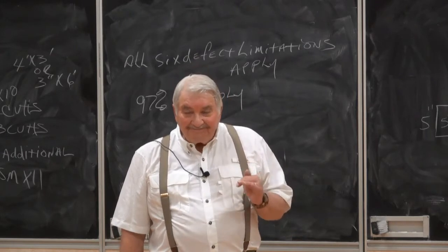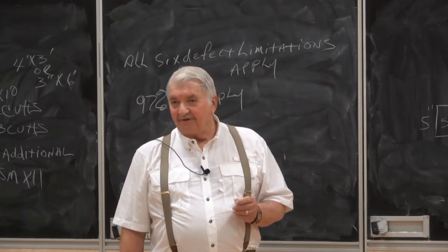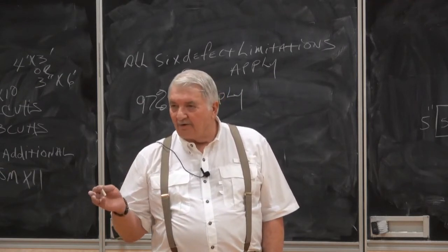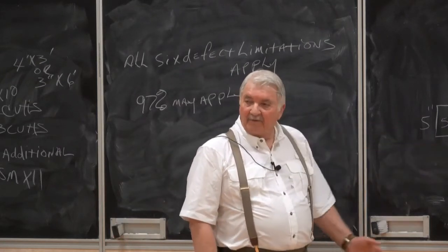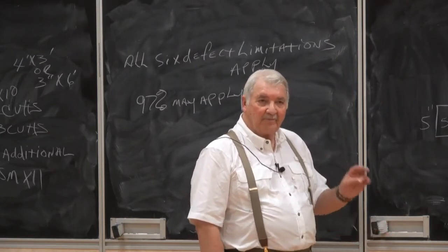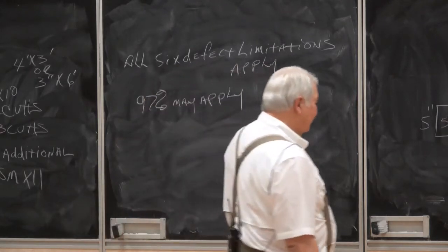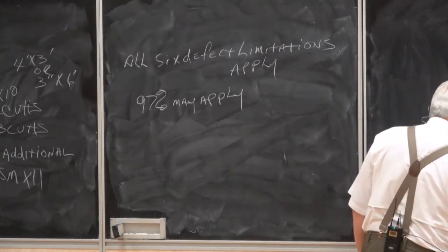Now, FAS one face walnut, that is a different deal. All right? If you have FAS one face walnut, there's two ways you can make an FAS one face walnut. One of them you're already familiar with, okay? You make FAS on the better face and a reverse side not below number one common, which we haven't talked about one common walnut yet. It's a little bit different, but at any rate, that one you're familiar with. Another way that you can make an FAS one face walnut is, and this will look different to you too.